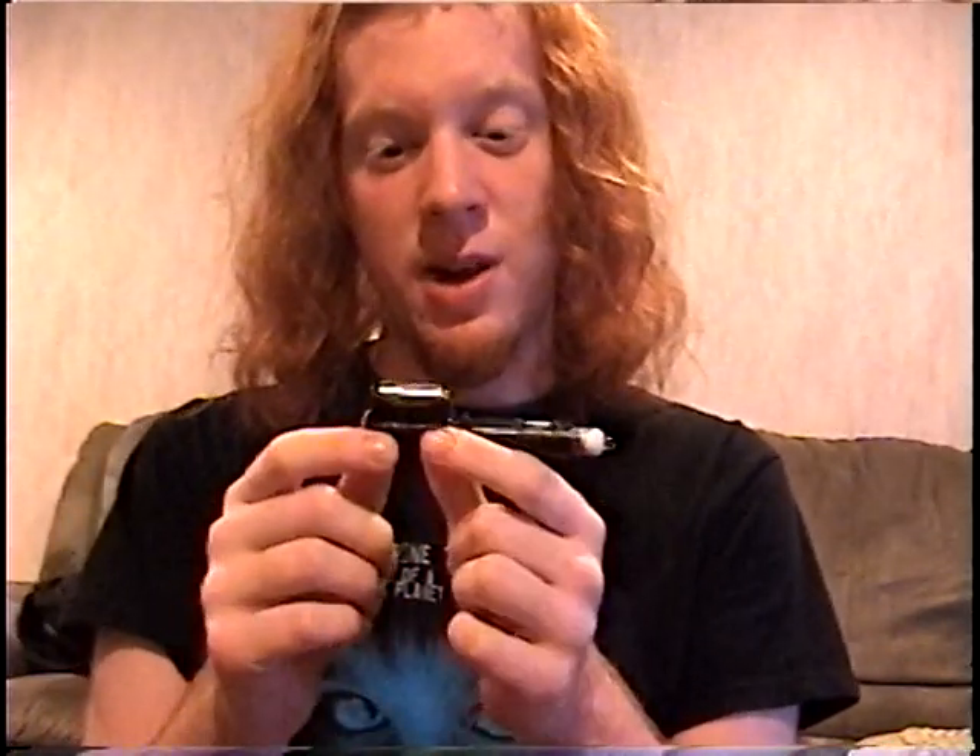To start off, what I had to do was create this little infrared pen. What I just did was took an old marker and gutted it out. I drilled the hole here and then started wiring everything. What we have here is an N-sized battery hooked up to a switch and an infrared LED in the back. All of these parts you can find at Radio Shack and it's really pretty inexpensive — I got all of this equipment for about ten bucks. The switch and the light alone are probably a dollar.